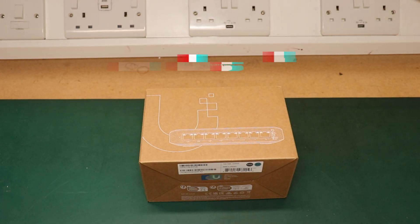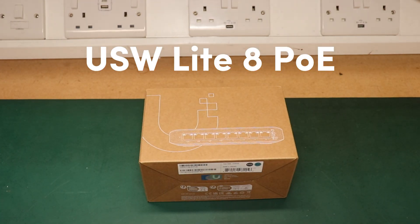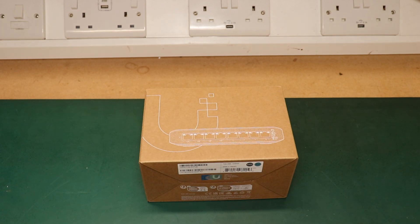Our next piece of equipment is an 8-port layer 2 POE switch. It has four POE plus gigabit ports and can offer 52 watts of total POE output. We're going to be using this switch to power an access point, and also to power some telephones. Looking at the specifications, it's got 52 watts with an external POE power adapter and can handle a maximum of 30 watts POE plus per port.